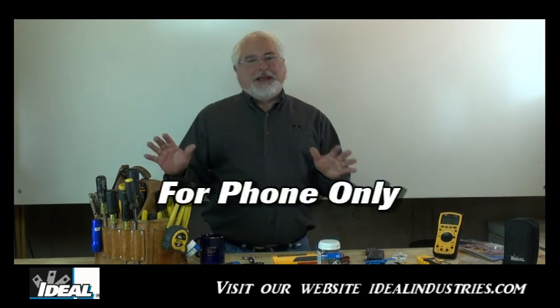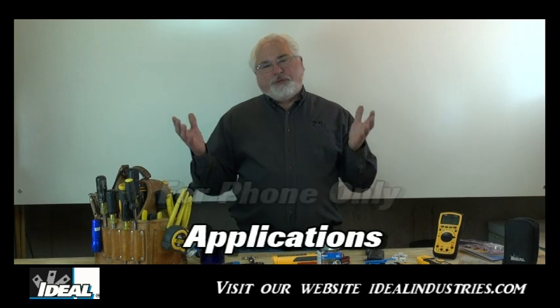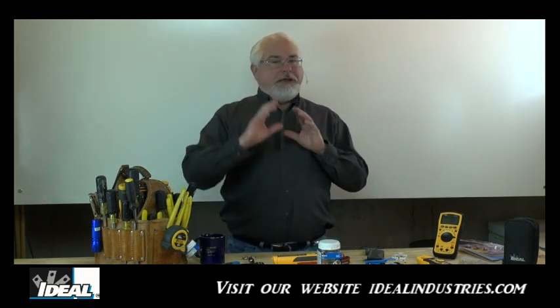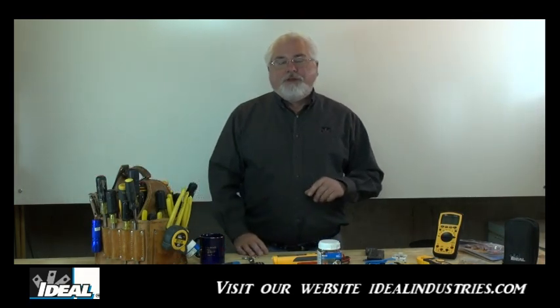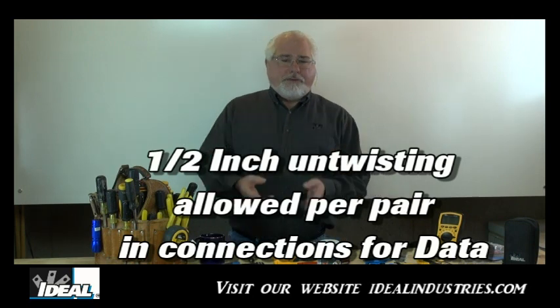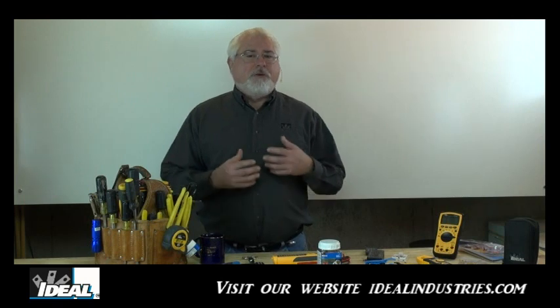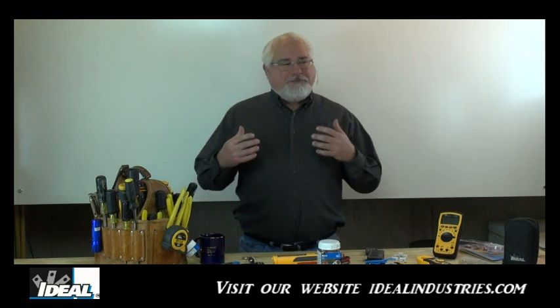Basically in a building. Now I said telephone wires, not data networking cable. Could you splice some Category 5e cable with these? Keep in mind that data networking cable requires a dedicated cable to each device, so you really can't tap off and feed another device. The other problem is that to use these connections we'd have to untwist quite a bit of cable, and with Category cable we're only allowed to leave half an inch untwisted on either end of a connector.